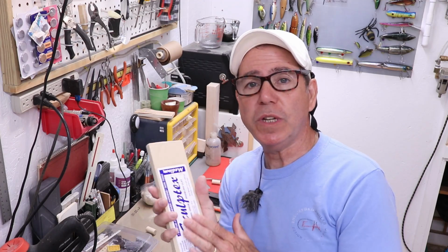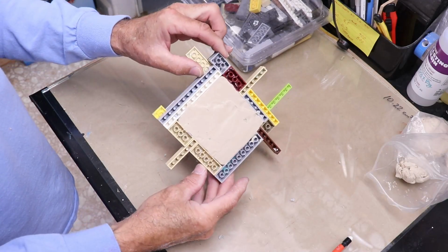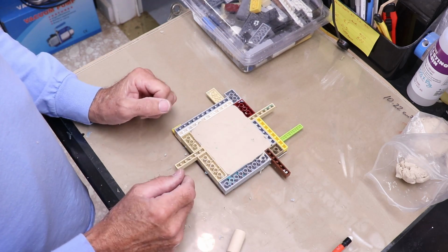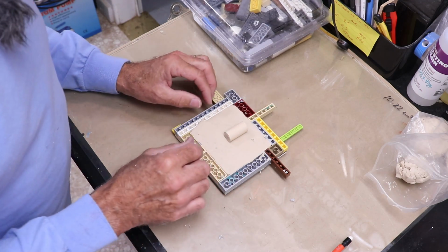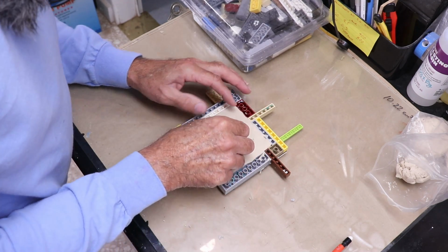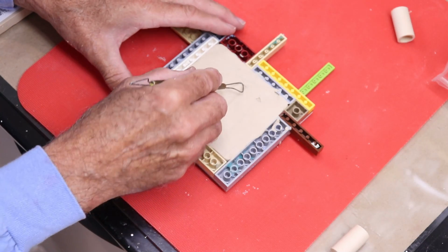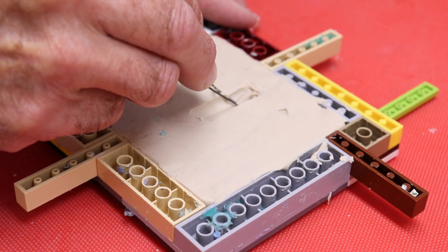It'll play nice with both the Tin Cure and the Platinum Cure molding silicone. All right, I had to get a little creative to get a 3½ by 3½, and a little more is better than too little. So the first thing I want to do is set my little reservoir cylinder, and I'll just eyeball that and make sure I've got just a little more than ½ inch. And since I want it embedded about halfway down, I'm going to go ahead and remove some clay.